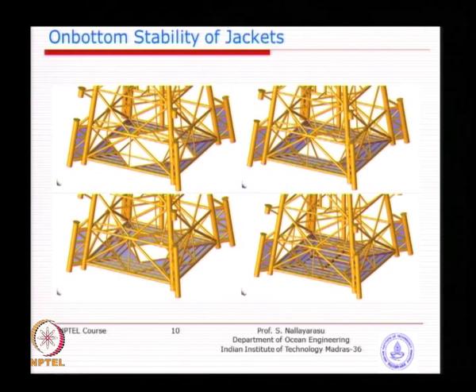The reason we provide openings instead of full mud mat is to reduce weight. But in very soft clay, if the foundation has a central hole, the soil at the middle tries to squeeze out as pressure is applied from the mud mat. Because of this squeezing effect, the capacity actually reduces and the jacket will try to penetrate. If you have a full mud mat without an opening, the squeezing effect does not happen — the soil cannot come out easily because the whole mud mat is covered. In such cases, even though load transfer efficiency is not higher, we prefer full mud mat to increase bearing capacity.